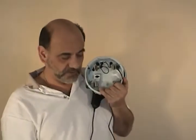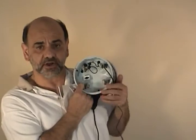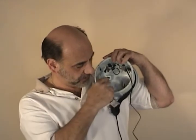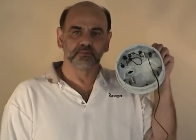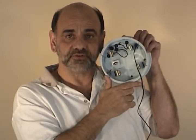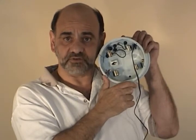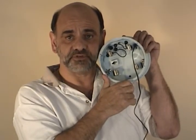Don't forget we have the nine o'clock position and there will be a six o'clock position where you can put the extra blade that we give you, if you need to pick up a neutral as opposed to using the neutral wire connection on the back. There's also a jumper included with a cotter pin that will allow you to jumper from this blade to the neutral connection on the inside of the unit. Remember the unit comes standard from the factory with a seven-day recording time period and set points at 126 volts and 114 volts, but you can change those set points and the recording time period to whatever you like.